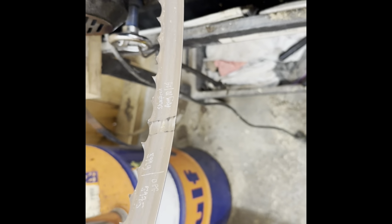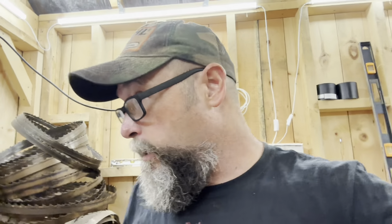And then when I install that blade, I'll put the hours that I start the cutting. So far I've noticed I'm getting about 6 full hours of cutting. That's 6 hours of the blade going through the wood before that blade is no good. Can't be sharpened anymore. And what I've been finding is that when I sharpen the blade too much, it'll start to crack, get a little micro fissure, usually in the middle of the gully, or the gullet, I should say.